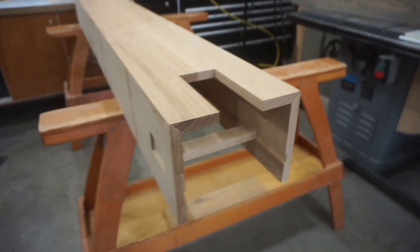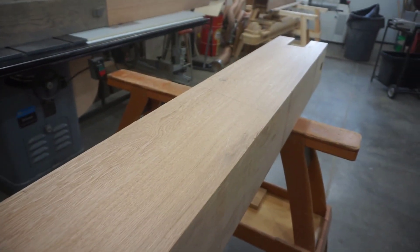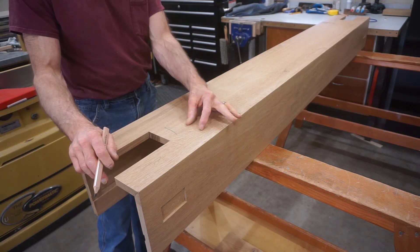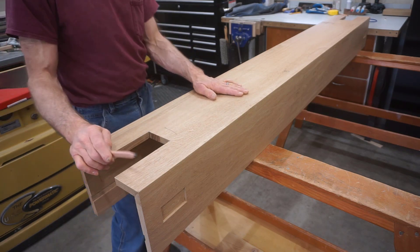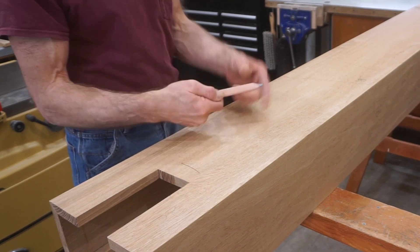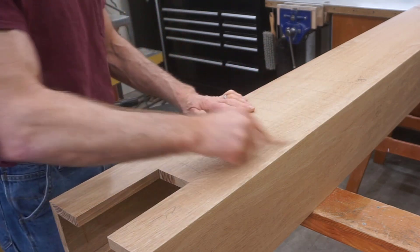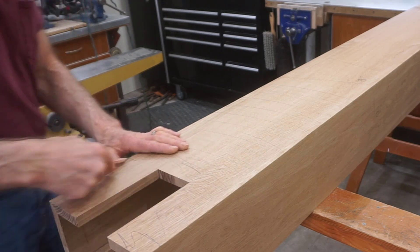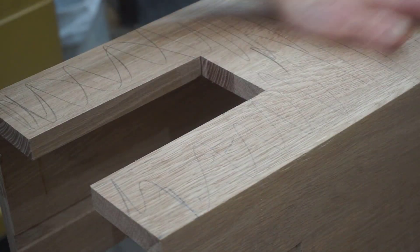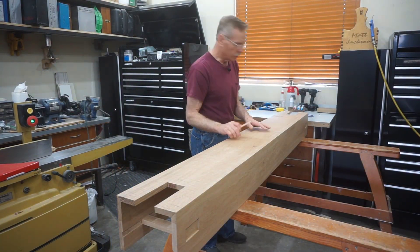If you watched the two previous videos about how to build these box beams, you'll understand that razor-sharp mitered corner is fit tightly and glued all the way through, and then the mortise and tenon joinery fits accurately with the other section. There's a crisp recess in the side where the tenon wedges go. It's a little bit of a shame to take this flawless beam and age it, but that's what the job's about. To ensure 100% coverage of the textured finish, I simply use a pencil and scribble lines across the surface close together.